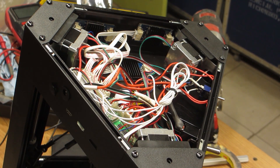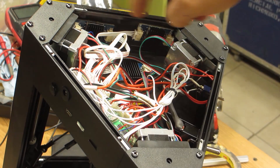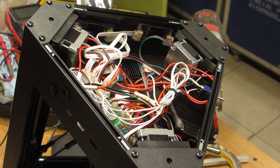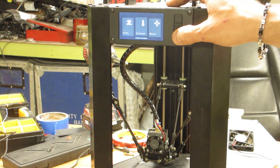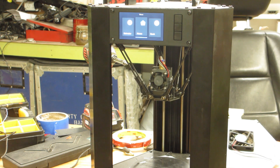The smoothers are in and the steppers and end stops have been switched. The auto-leveling bed switches don't have to be switched at all — I think they're hooked up in series so it doesn't really matter. That's about it for the wiring. Let's power this thing up and see what it sounds like. Well, that looks and sounds pretty good.